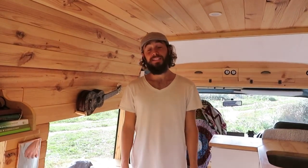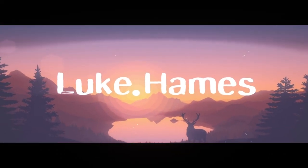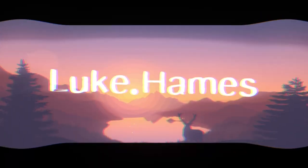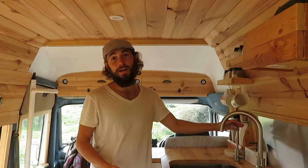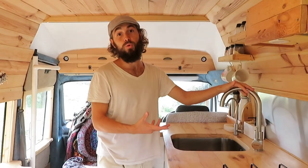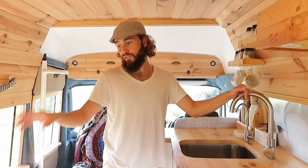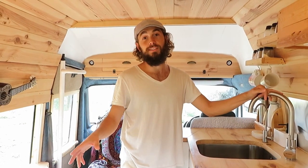Hello, welcome to another video. In today's video I'm going to take you through how our water system works in the van. So this is what we do for water. We've got one separate tap for our drinking water that runs into a 25 litre tank, and we've got another tap for our normal water which runs into another 25 litre tank, but then we have two backup tanks on the other side, making it a total 75 litre tank.